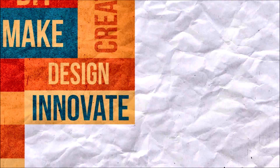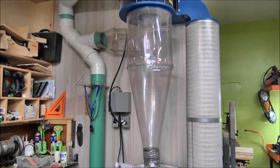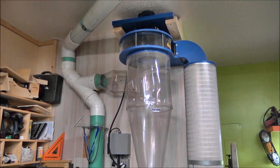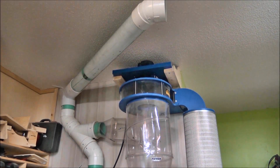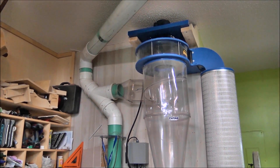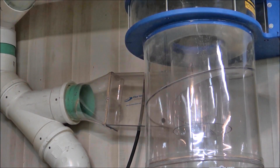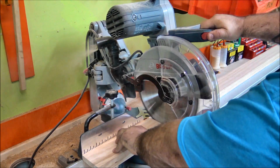Let's talk about the CV 1800 that I got from Clearview with a 5-horsepower motor. The CV 1800 from Clearview Cyclones moves 1900 cubic feet of air per minute, which means it cycles the air in my shop about every two to two and a half minutes. The manufacturer recommends a five-foot section of straight pipe coming off the separator, which I wasn't able to do because of limited space. There is some assembly required — I'll post videos in the description. Today we're focusing on installing the ductwork and modifying a table saw to work with the piping.